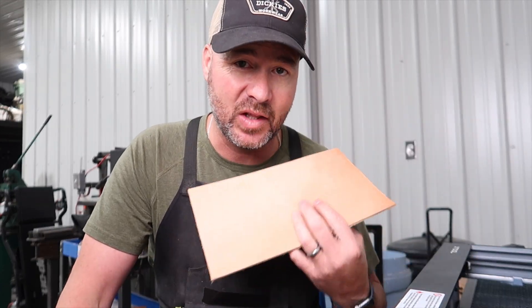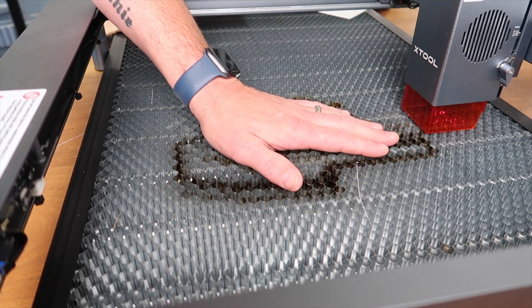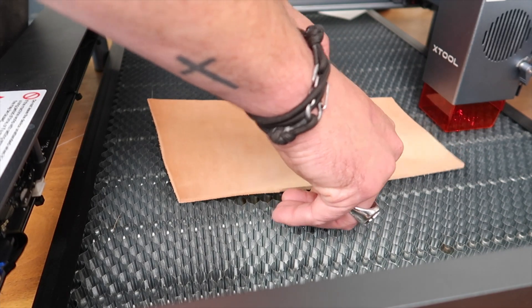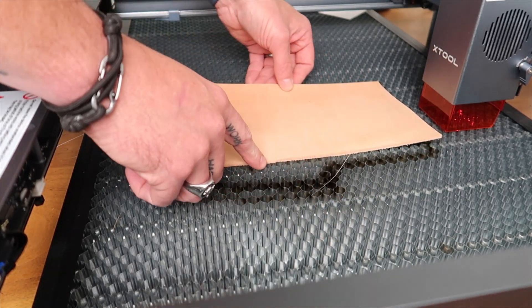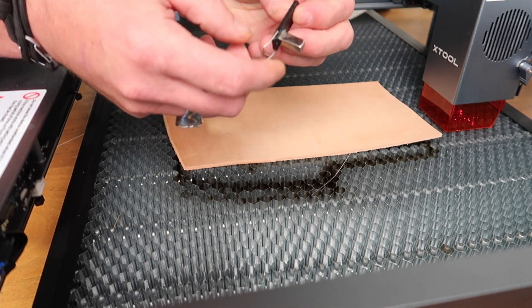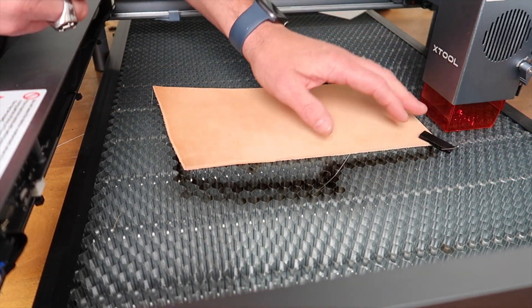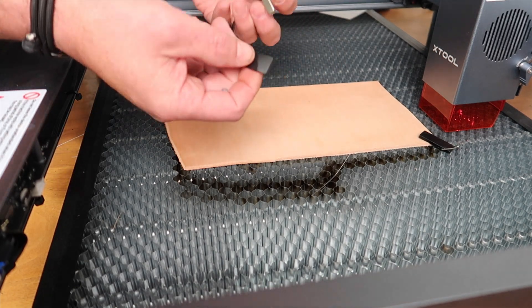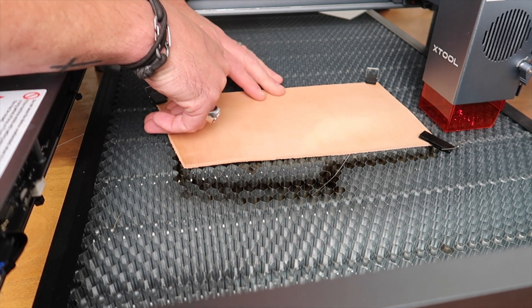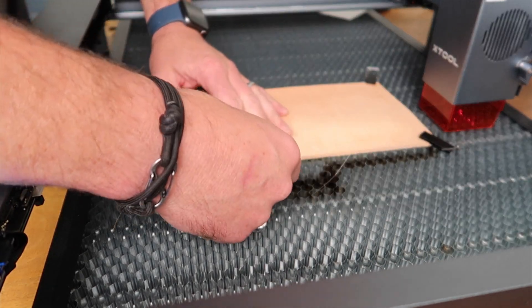We're going to go ahead and put our leather in here. Now the one thing is this stinks and it creates a lot of smoke. I do not have a dust extraction set up for this thing yet. So let's get this leather clamped in here and we'll get cutting. You can kind of see the burn marks from where I've been testing out some other sheaths — and that's fine, I don't think it really hurts anything. I'll just line it up with these bars going across. X-Tool sends these little aluminum pieces with a bar magnet on the bottom, and they drop into the honeycomb and hold the leather down. Especially when your leather has been rolled up for a while like this one has, it's nice to get it nice and flat.